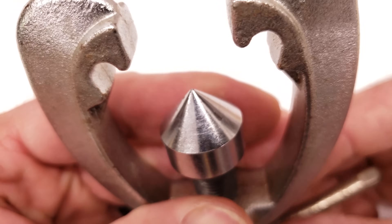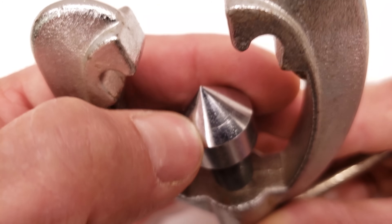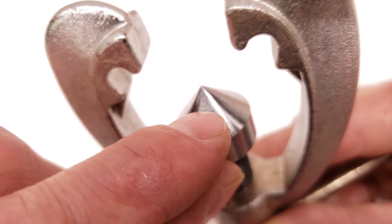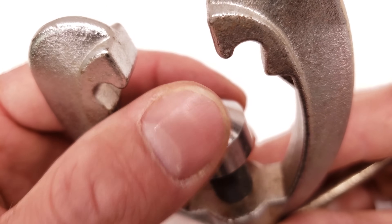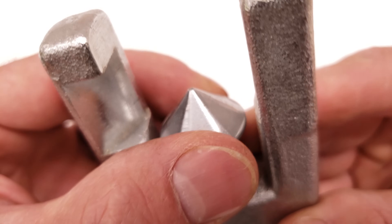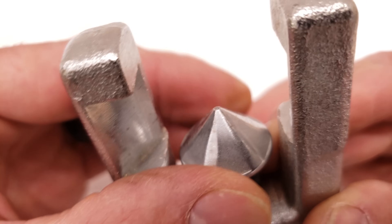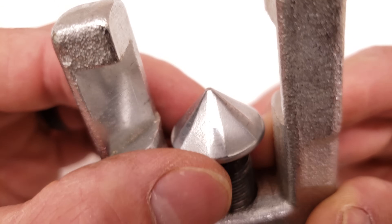Here's a standard cone — there's nothing special about it, it's just a standard one. It also has to do with how glossy the finish on the cone is; the glossier it is the less porous it is, which means you're going to have a better flare joint. This version of the flare cone only allows a certain part of the cone to touch the copper at a time, so there's less surface contact with the copper tubing.